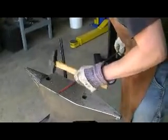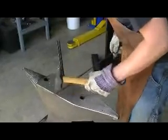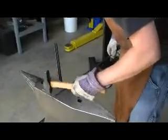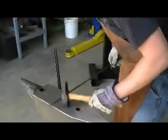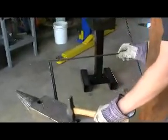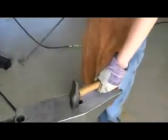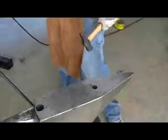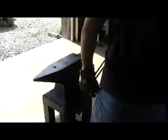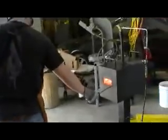You'll notice he's taking it from there, still working on the square cross-section down to a point. A couple of things you need to keep track of when you first start blacksmithing: there's some hammer prep. When you buy a new hammer, there are sharp edges on the hammer, and I'll show you some of that here in just a second. You have to sand those off to prevent indenting the anvil. In some cases the edge of the anvil also has to be dressed up.